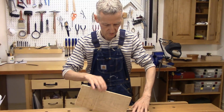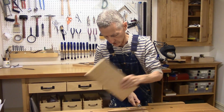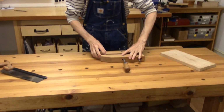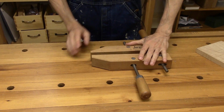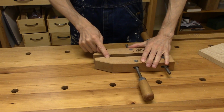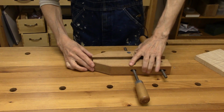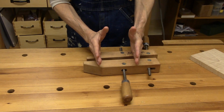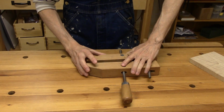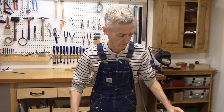It's made of wood, of course, so it's very gentle on things that you clamp. It's non-marring. And also being wood again, you can carve this or cut this or fashion this into some sort of customized purpose. I see a lot of people cut notches in the jaws like this. In that way they can clamp dowel rods or pipes or cylindrical objects. So very, very useful clamp. They come in all sizes, tiny little ones for model making and great big ones for other projects. I've got about 6 of these and I need about 6 more. So just fantastic clamps.